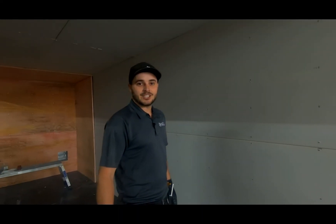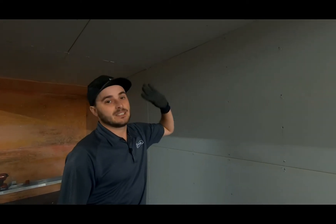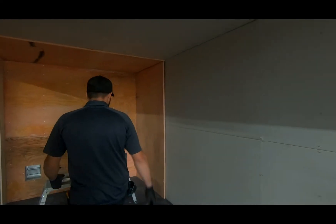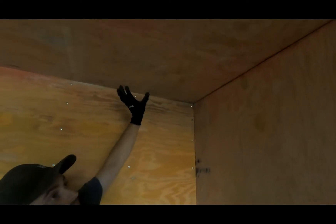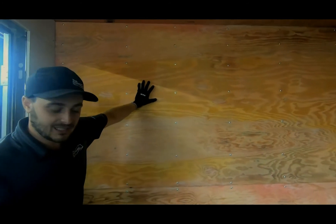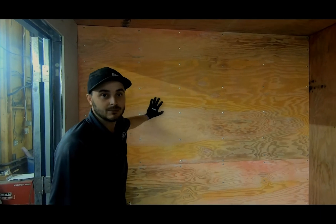We're back to check in on the progress. They have the walls and ceiling all with the first layer of 5/8 Type-X drywall and just started on the three-quarter inch fire-rated plywood. The end walls and the first sheet in the ceiling are installed. We put the ceiling sheets in first and then the sidewalls so they can hold the sheets up. The plumber will be here shortly to start mounting the upper head unit for our split air conditioner.